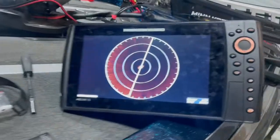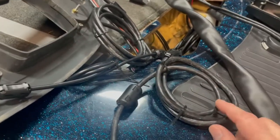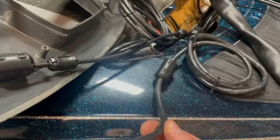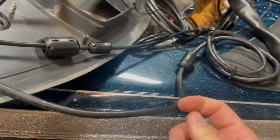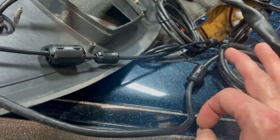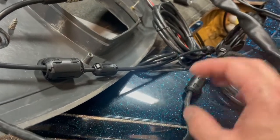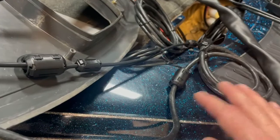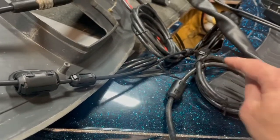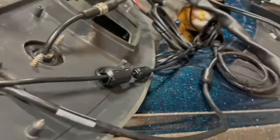Just running at 30% — you can see the interference is back. I've got all these rings and I've tried different size loops; it doesn't seem to make a difference. From what I found on the internet: you have wires going in both directions, positive and negative, and if they have mismatching magnetic signals on each wire, that's where you're getting interference. What you're trying to do with ferrite rings is mesh the radio frequencies so they cancel each other out, which is why you loop all your wires through them.